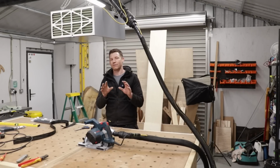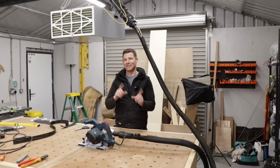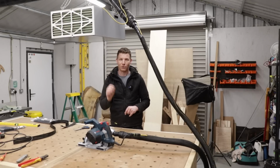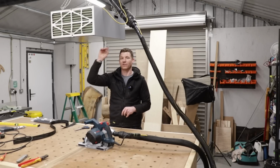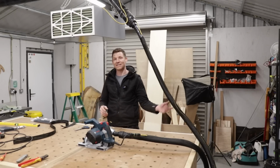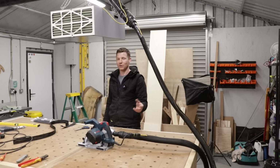Now you guys will also have seen me make a video about extension leads and how I absolutely detest extension leads as a permanent solution. However, this is a bit different. The flex that I've used, or the cord that I've used, is twice the diameter of the one that comes with the tool. It is the size of the cable that I would have been running for a socket anyway, so it's actually increased the carrying capacity of the circuit, even though I've technically lengthened the flex all the way over to my socket from this power tool. It's large enough to do exactly what I needed to do, so that's actually fine.